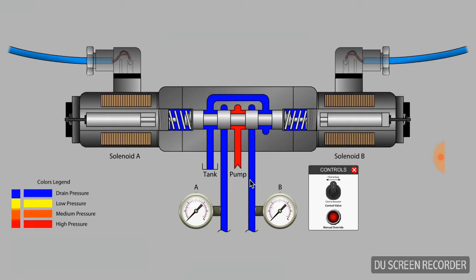or motor. When we energize the solenoid coil on the left side of the valve, an electromagnetic field is created. The field pulls the armature in towards the center of the winding. The armature slides easily in a tube that is internally lubricated with hydraulic oil. The armature moves the push pin, and ultimately the push pin moves the valve spool.